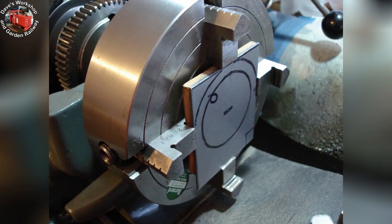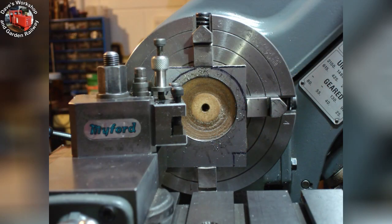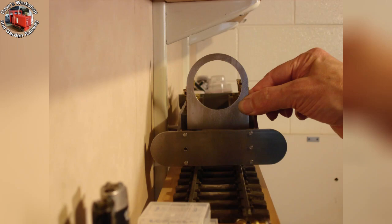An MDF backing piece to allow tool run-through, as the backs of the jaws are otherwise in the way. Initial boring out using a high-speed steel holesaw — it is the best size that I had. Bored to size: 2.1 inches or 53.3mm diameter. Cleaned up, ready for profiling. Radiused by sawing, grinding, and filing. It took a long time, but that's okay.